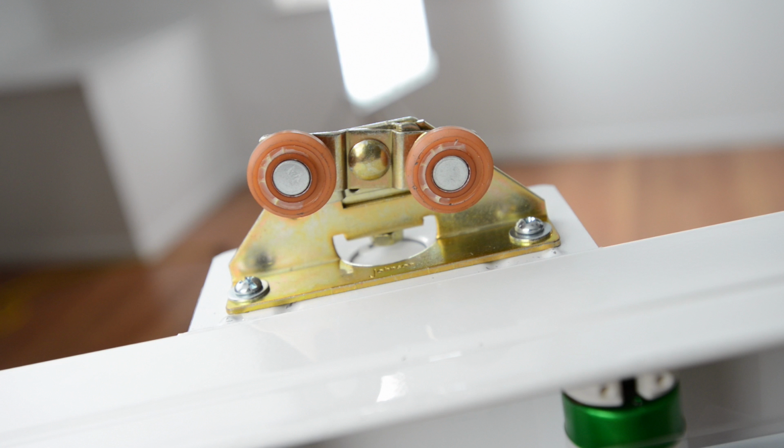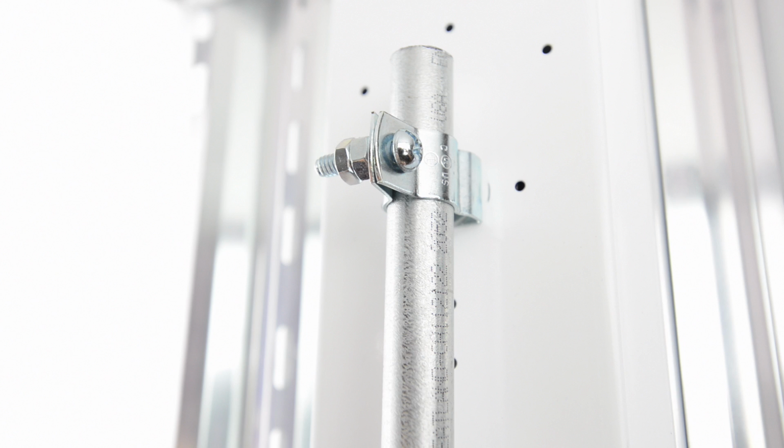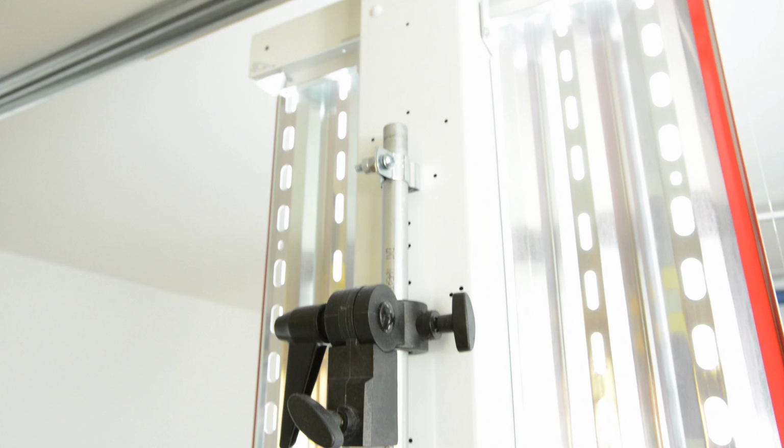This is the perfect balance point so that the unit hangs straight and not tilted. I used 2 of the holes that are already drilled into the back of the ballast housing to mount 2 size 0 standoff hangers, one near the top, one near the bottom. Then I cut the half-inch conduit pipe in half and placed a 30-inch section between the standoff hangers.